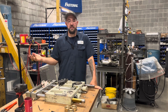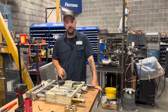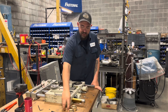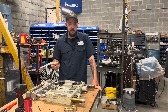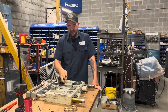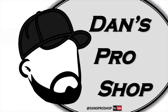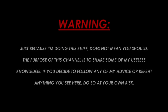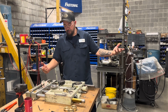Luckily enough our parent company is a machine shop, so I just took this thing apart, reverse engineered everything, made a set of drawings, and sent them down to them. Now we got brand new bull gears, fancy stainless, and some serviceable bushings, so this thing doesn't have to necessarily come apart a hundred percent to fix it in the future — I can just throw new bushings in it.